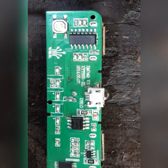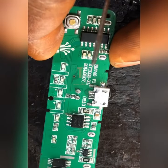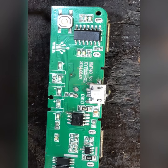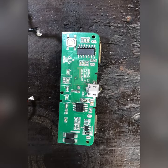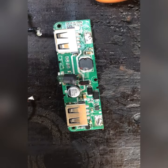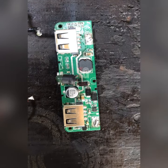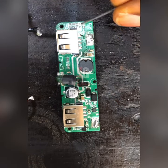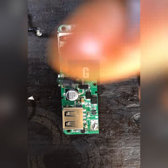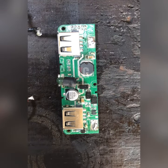The first thing I did when I disassembled the power bank board was to check the output that is going to the battery connector. This is the battery connector — you can see this is the connection here. This is plus and this is minus. When I checked it with my multimeter, instead of four volts, it was giving me zero point five six volts.